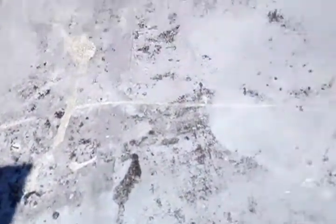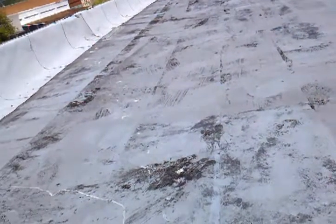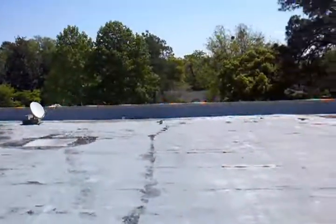The weakness of these systems are the seams where these areas are overlapped — that's where it'll begin to fail. It's been coated with an aluminum coat top coat to keep the sun off of it, which is starting to deteriorate rapidly. You can see all the dark spots; that's where it's coming off.